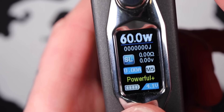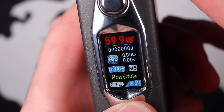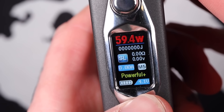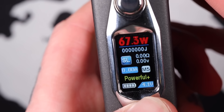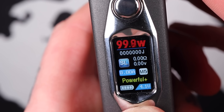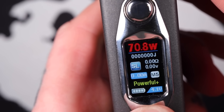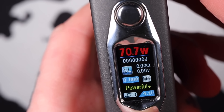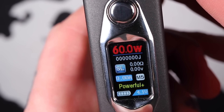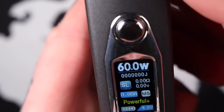There are obviously a bunch of different things that the joystick will do depending on what mode you're in. If I give it a click downwards, I can then adjust my wattage. I just hit straight down on the joystick — it goes in 0.1 watt increments. You can ramp it all the way up to 100 watts. I will point out that on a single 18650, it's not going to do 100 watts for very long — this is really designed for around 85 watts and under for consistent power.